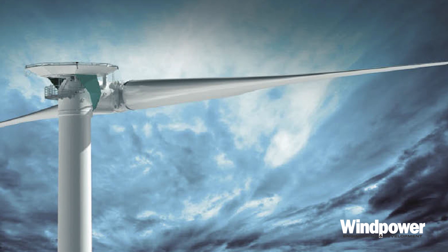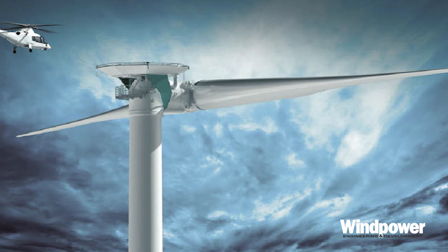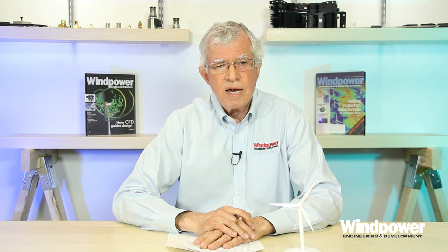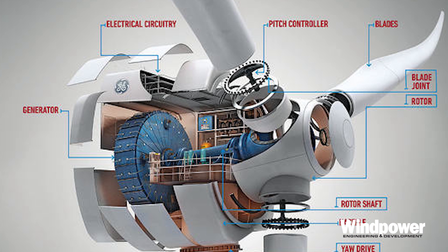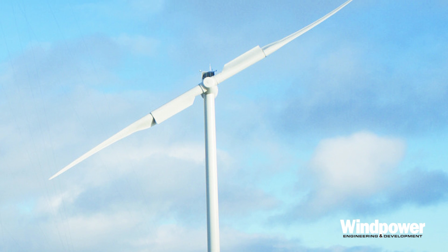You've probably heard about direct drive turbines. They're so-called because they have no gearbox, and the reason for getting rid of the gearbox is that it's been a trouble-prone unit. In direct drive turbines, the main shaft directly connects the rotor to the generator — a permanent magnet, or so-called PM generator. In this design, powerful magnets produce magnetic fields, and spinning the copper coils through the magnetic fields generates electric current. You may ask: if this setup gets rid of the gearbox, why aren't all turbines equipped with permanent magnet generators?